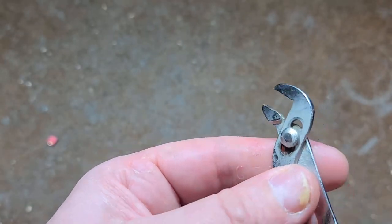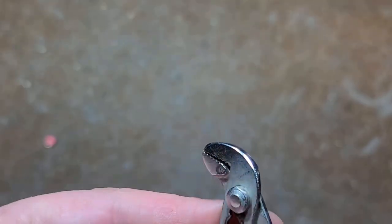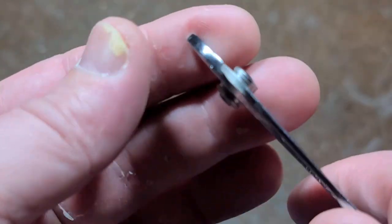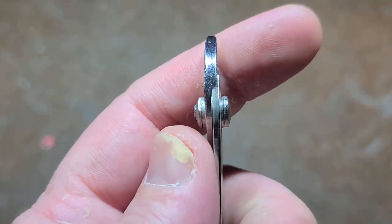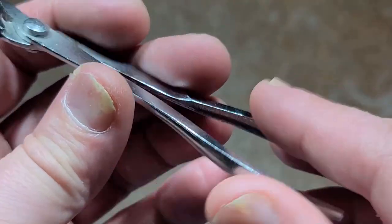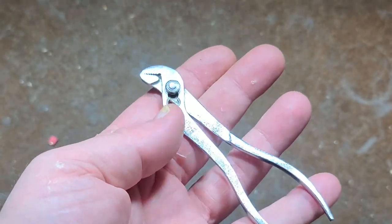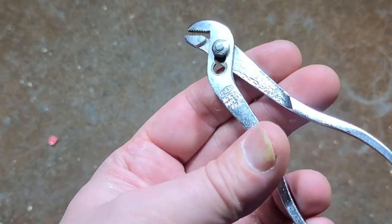There are all sorts of little jobs — particularly when taking apart electronics, fixing power tools, trying to remove or insert terminals inside power tools, or manipulating wires in tight spaces. It's just neat to have pliers that are super thin. These things probably only weigh about 50 grams. Little ignition pliers like this are about the smallest set of adjustable pliers you can find.